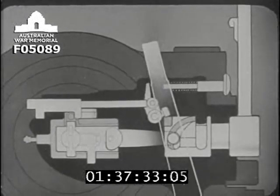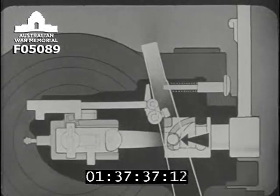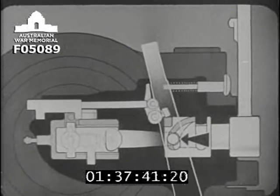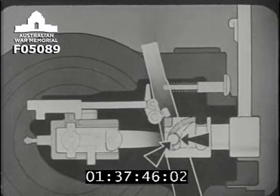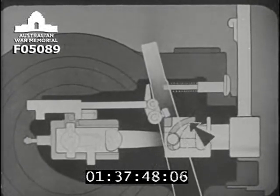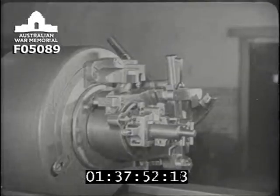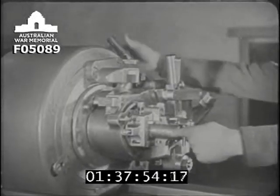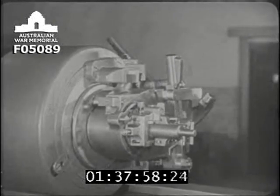This time, notice that although the retracting bar moves to the left at once when the LBM is turned, the lock has not begun to open. It will only do so when the catch plunger reaches the curved portion of the left-hand cam groove. This ensures that the firing pin is withdrawn before the lock starts to move to the right. Otherwise, it would be sheared off.